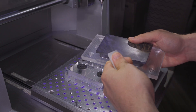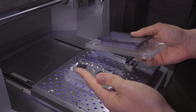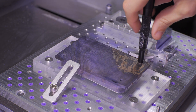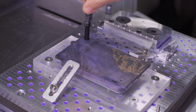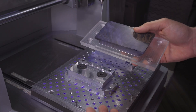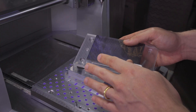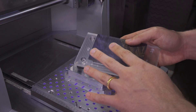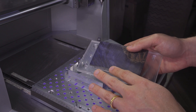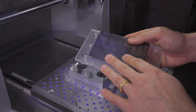Because we need access to the entire top face, we cannot use clamps to hold the workpiece into the fixture because the tool would just cut right through them — that's obviously not great. To get around that, I'll temporarily hold the workpiece down with standard clamps and bore out the holes for the screws to go into. The workpiece will then be fastened directly to the fixture using four M2 screws, and I can safely remove the clamps and complete the milling. If I were milling a shell out of aluminum or some other soft metal, I would likely want a stronger material for the fixture. Acrylic does not hold threads very well because of how soft it is, so if cutting forces are especially high, the threads may fail, with the end result being the workpiece getting violently separated from the fixture. Because this is a soft material — a running theme here — I should be able to get away with this, but I'll take lighter cuts than the previous step regardless, just to be safe.